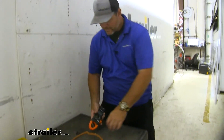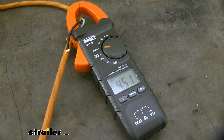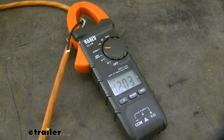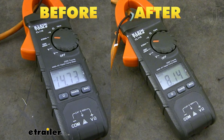Now that we've got it installed, we're going to go ahead and do the same test that we did before to see if we get any changes. After we put the soft start in place and tested it out, you can see a significant difference between the first test and the second one with the soft start in place. First test came out at about 15. Second test, with the soft start, tested at about 9. So we have quite a bit of a difference there.